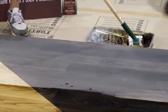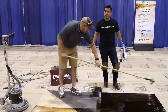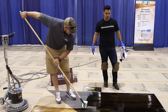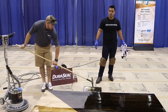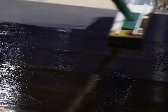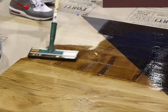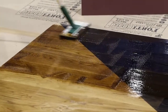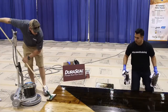You can see we're not doing a very thorough wiping job — that's because we're still going to buff with the steel wool to burnish the grain in. The Quick Coat has always been a finish, but in the industry we've always known it as a stain. An entire generation of flooring people have kind of forgotten about this process. If you go back 40 or 50 years, that was a very common floor — two coats of the original penetrating finish buffed in with steel wool, and for a really premium floor, you might add a coat of paste wax. That would have been the good and better options 50 or 60 years ago. So Dan's wrapping up on the application and we're going to start burnishing the grain with the steel wool pads.